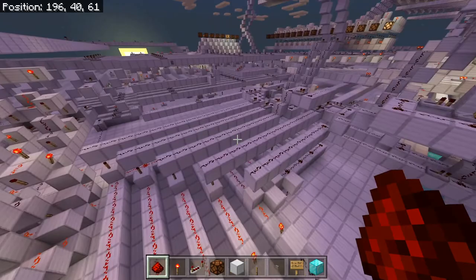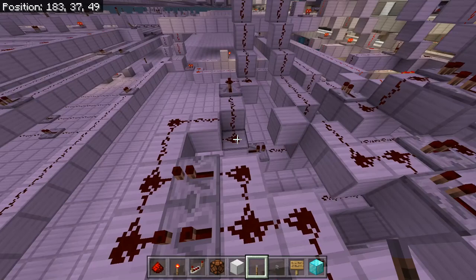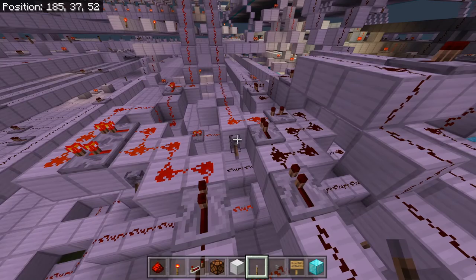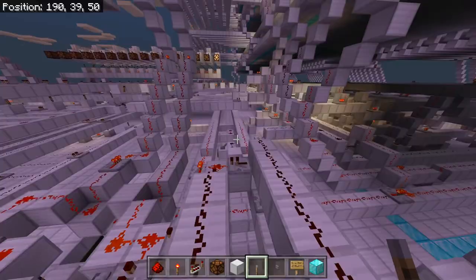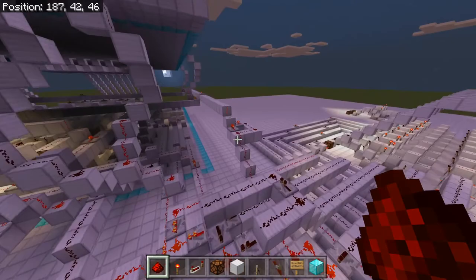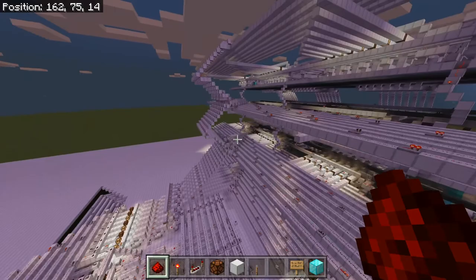Don't really want the address to keep changing. So what I'm going to do is force the address to be all ones. So that way we're always saving into the same address. It'll be the top corner. And actually, the rear row here is going to be the slowest. So we should now be saving. Tell you what, I can also destroy this to make sure that we're not adjusting the row all the time. So we should now be saving into the backmost row, top left-hand bit.